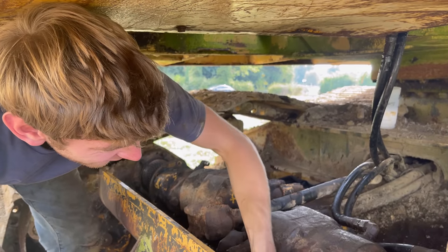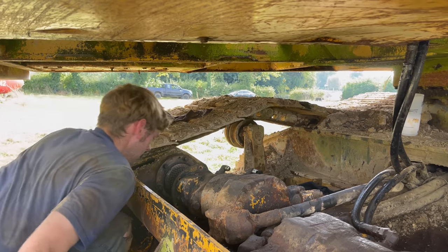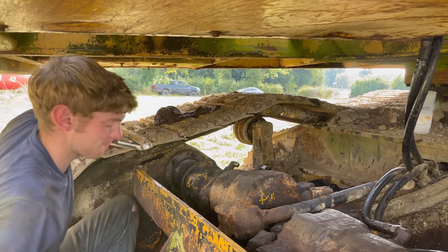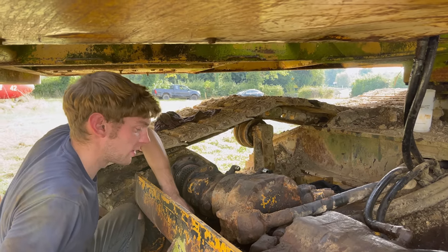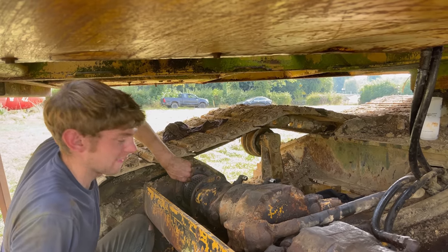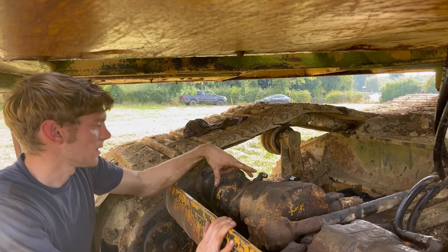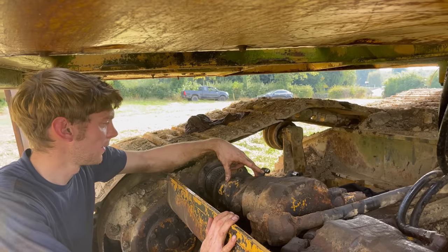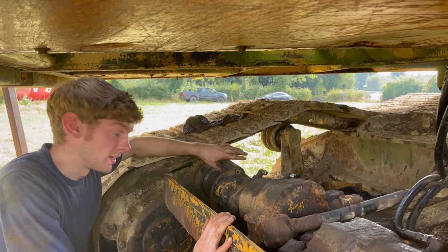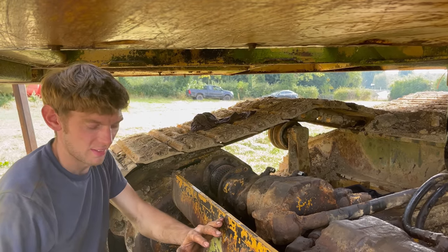One motor back on. Now I've got to split the other one and put the clutch plates in that housing. Because you can't get the teeth to line up because you've got two sets of teeth to line up. Some idiot thought of that, but it's a terrible idea. So I need to take that housing, part this pump, then take the brake ram to pieces in the pump, then put that trumpet housing on, then slide the clutch plates or the brake packs in, then put the ram back together, then put the back of the pump on. Nice and easy.